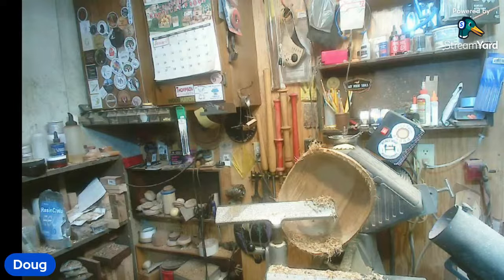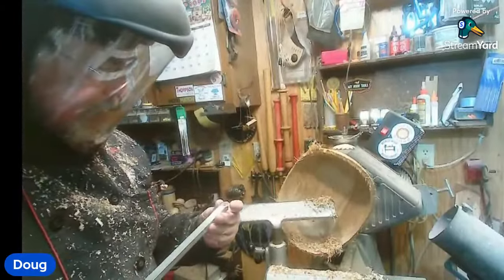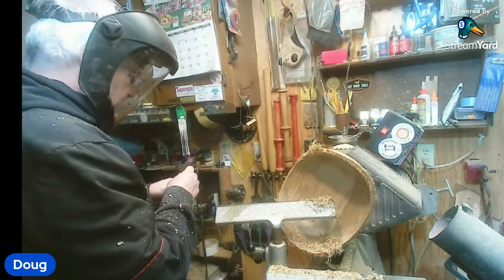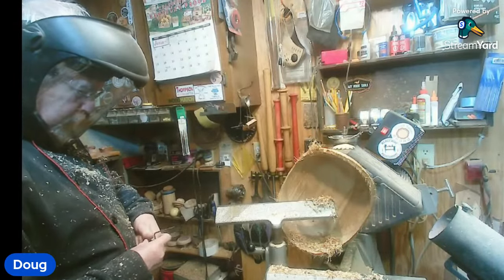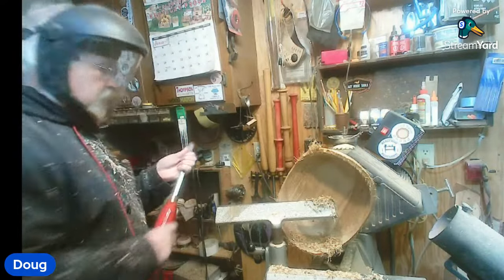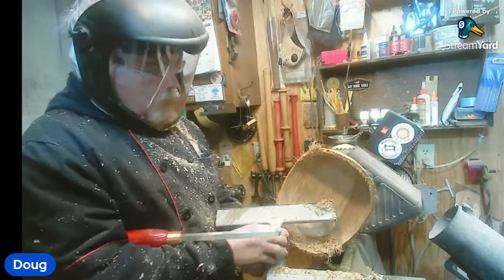Do you have a round easy wood? I do. I was using that a while ago. You could use it, it's a finishing tool. You could use it on this section here. Let's see what it'll do. Just make sure you elevate. You'll find if you check where center is, you'll find you have to elevate the tool rest a bit. Yeah, it should be. Well, it's above center now. Got to turn my cutter. And if this doesn't do it, I do have another one. I'm seeing it right now. We can change if I need to. Okay. Yeah, I'm well above center now. Anyway. Okay, because you can always lift the handle.